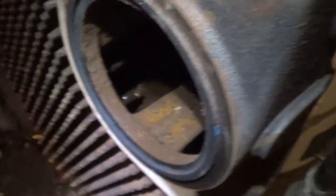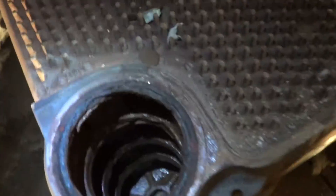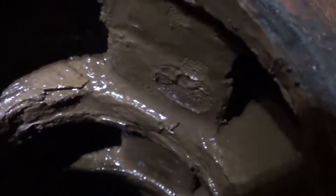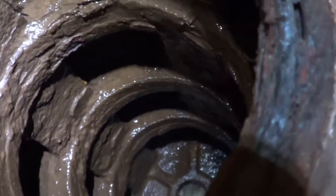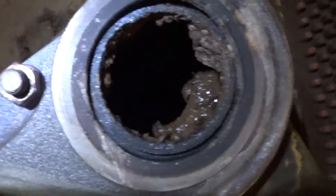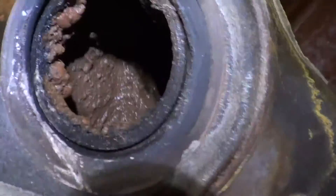Let me show you here — right around here, you see right there, it's starting to flake off. Some of those spots peel off with your finger. There was a big one right there — it just popped right off. The oxygen gets underneath and it starts splitting the iron like cement. Here's the condensate side. It's starting to get pretty fouled up in there.